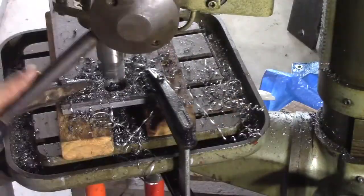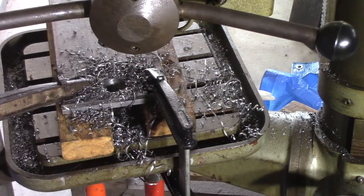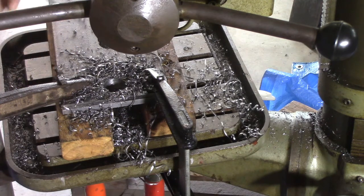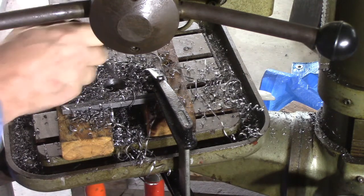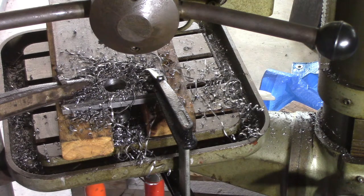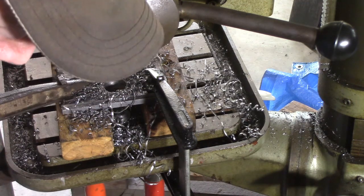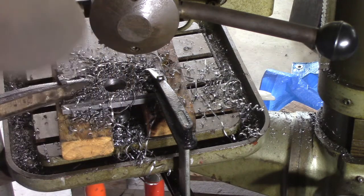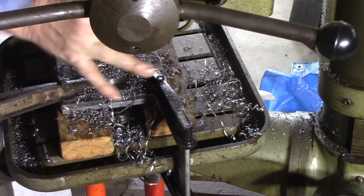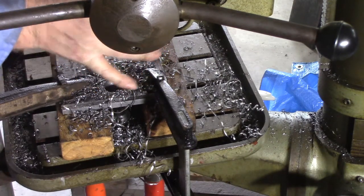Now onto the second 32mm hole through the other pair. Well, this Australian cutter costs an awful lot more than the Chinese variety. I'm very happy with the way it cuts though — if I paid that much extra for it I'd be really unhappy if it didn't cut well. The 38mm cutter I'm about to use next is from the US. Quite honestly, while it cuts nice, the 32mm one probably cuts the nicest. Maybe the speed and feed rates are just matched better to the size. The 38mm doesn't seem to cut quite as nice, but the other smaller Chinese cutters cut just as well. The shape of the teeth is a little bit different — I think the shape of these teeth is a little bit more refined and it does a nicer job.